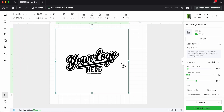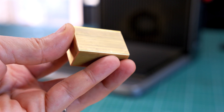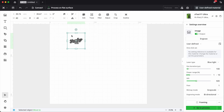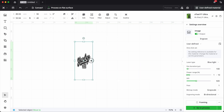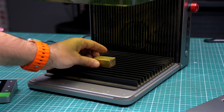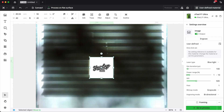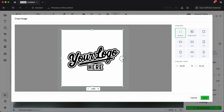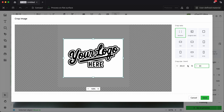It has to be black and white and have a decent resolution. No gray, no color whatsoever. Now scale the image to the size of your material. I will use this solid block of brass, which is about 30 millimeters by 40. In this window here, you can input exactly the size you want. Be sure to have the aspect ratio selected, otherwise you will distort the image when you size it. Place the material inside the laser and click the camera to get an image of your work area so you can adjust it even further. You can also crop the image, and for this operation I will uncheck the aspect ratio as needed and use the width and height windows to get everything just right.